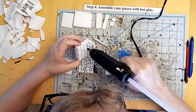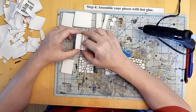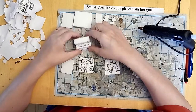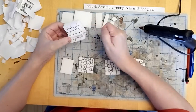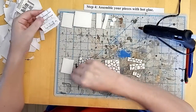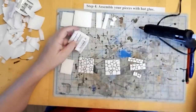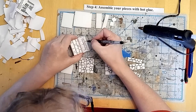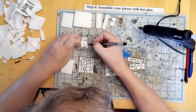And now I'm going to put on the mantelpiece above the firebox — texture side out of course. Get it nicely lined up. Got some glue strings to deal with. And now I'm just going to continue those mortar lines onto the surfaces that are now visible.